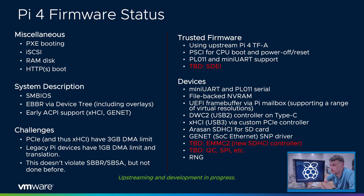The goal of this project is not to create some academic firmware that by throwing away 90% of the board's functionality claims success. Today with ACPI we're exposing USB, networking, and at least one SD host controller. More devices should be possible — we do expose much more, but OS support for those is nonexistent in Linux; nobody has done that work. NetBSD and OpenBSD today are probably the best operating systems in terms of support for the platform using ACPI bindings.